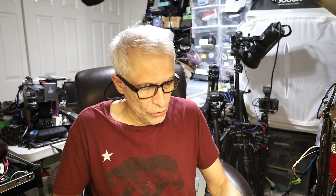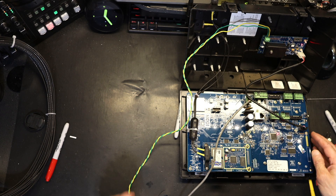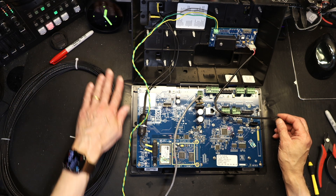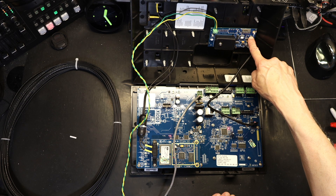Once you connect it, you restart the base station so the vehicle detector can detect the default normal inductance with no vehicle present. To calibrate it: make sure there is no car on the coil, then unplug the connector and plug it back in so the detector gets used to the normal inductance with no load. Once it has calibrated, the light will be off. Then when a car comes, the vehicle detection will enable.